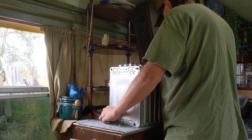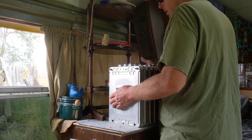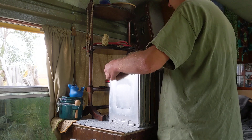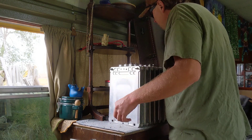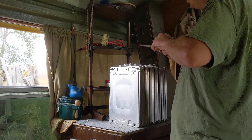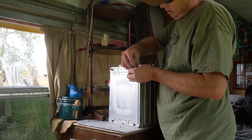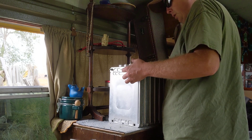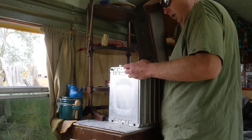All of these together are going to be 48 volts. Now that we've got these together, it's going to be easy to parallel this positive connection with a bus bar, but then we're going to use a six-gauge wire to make the outside negative connection.